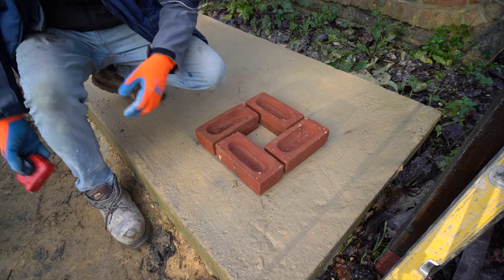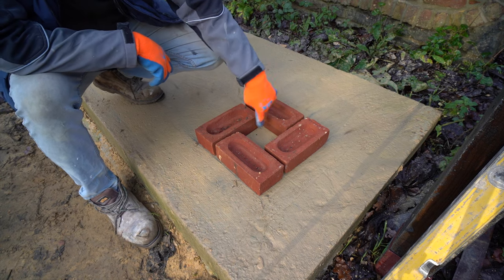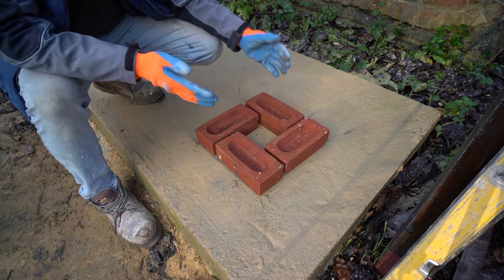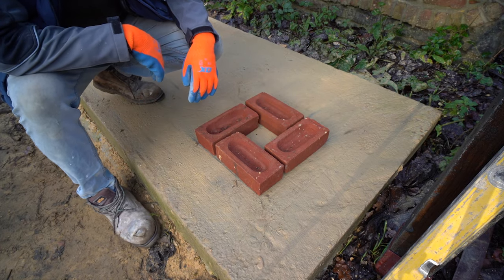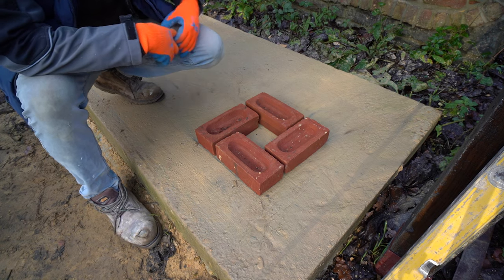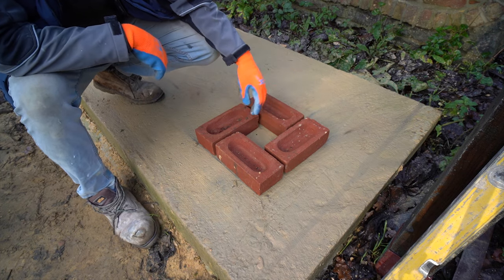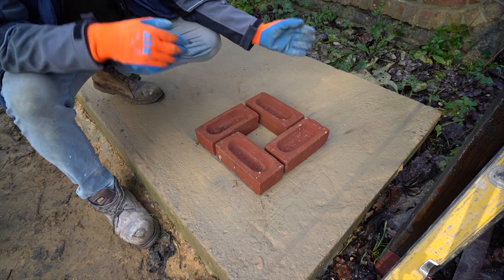While we're on the subject, let's talk about the middle. When you build this up, I like to build it up and leave a gap in the middle and fill it with concrete afterwards. There are two reasons. Number one: if I put a half brick in there and muck it in as I go, there's a tendency it could spread — it will spread out of plumb. This happened to me once when I was an apprentice. I built a pier out front of someone's front door and it spread, probably because I wasn't paying attention. Ever since then I don't put bricks in the middle — I fill them with concrete afterwards.